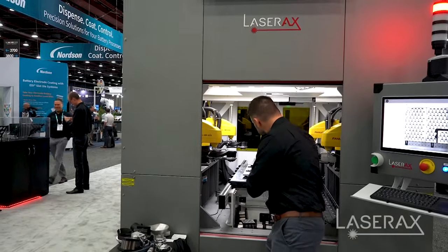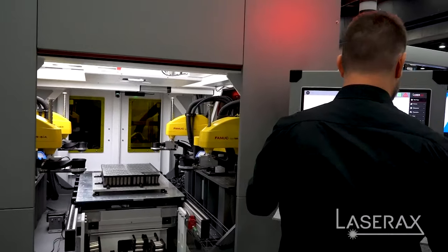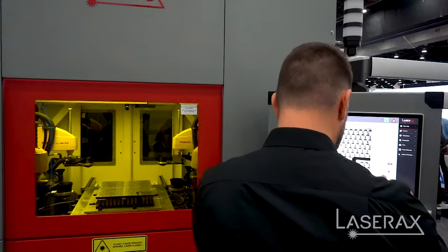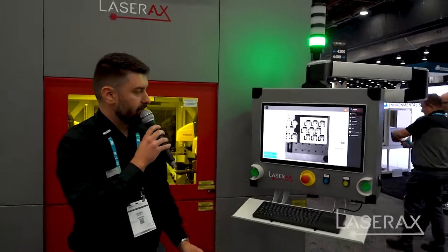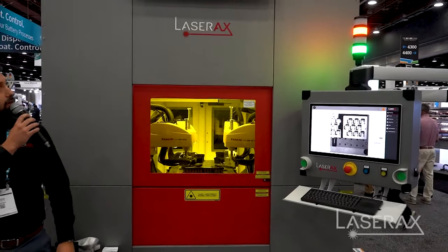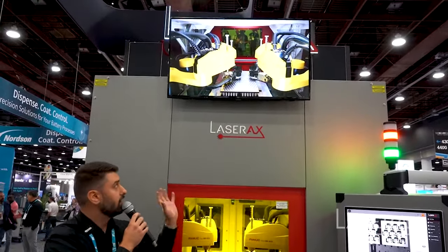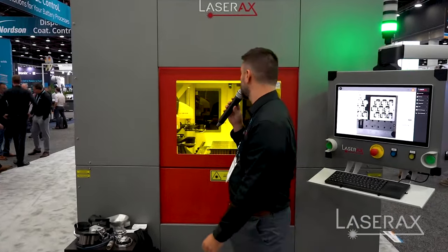I'm going to put it in the machine now. For those of you with a view of the HMI, you'll see the module captured and then the welding will start. The clamping tool is hiding it a bit, but we've just welded nine cells. The full-pace throughput for 21700 is roughly 10 cells per second — 100 milliseconds per cell during welding.